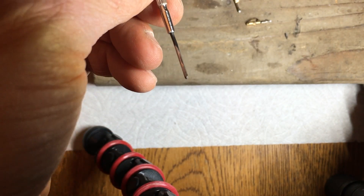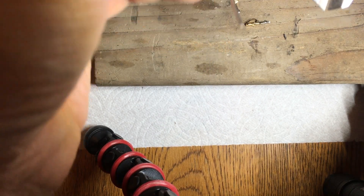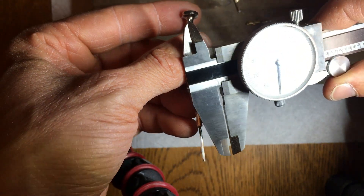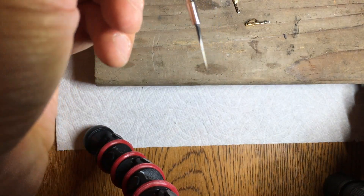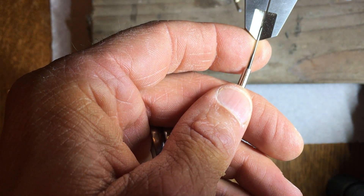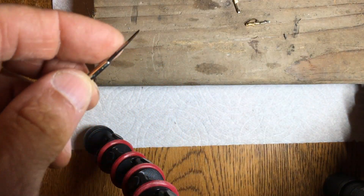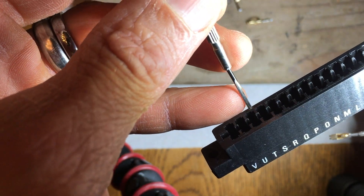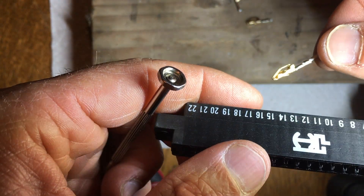The tool I used started out as a really small jeweler's flat blade screwdriver and I just ground it down so that its width was about 0.05 inches. It's also very thin — probably about 0.025 inches thick. It's pretty thin and pretty narrow because it has to get right into these grooves. You can see this channel on the connector — it has to slide right down in there. Once you make this tool, it's very easy to push that tang back and slide these out.